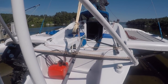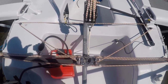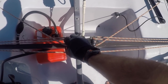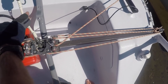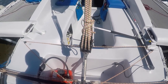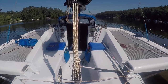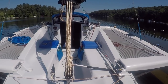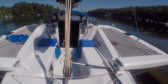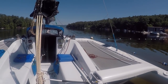Windward sheeting — this is discussed in the recent past, so I get a chance to show it; it's kind of hard to visualize. If I put pressure on this direction, as the sail would, these jaws will close. You can see the slight movement this way — those jaws close. So real quick tacking: I do it in about 10 to 15 seconds. I literally put the helm over, release the jib, unwrap it, immediately sheeted in from the other side to my two or three marks depending on how many wraps I have, cleat it, turn around, steer to course, and raise the traveler above the center line. It's that quick. And with the deep daggers, this boat just pivots.